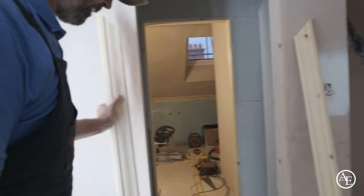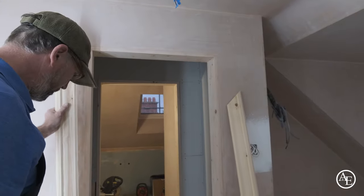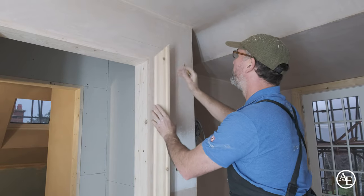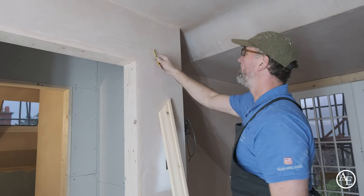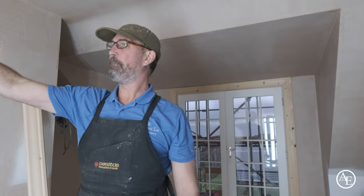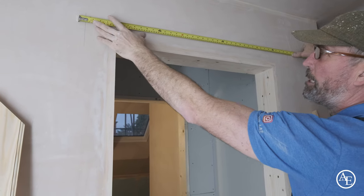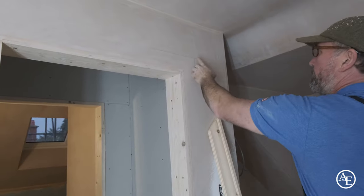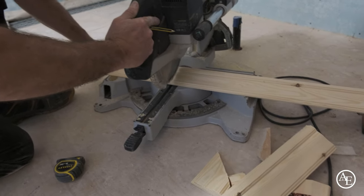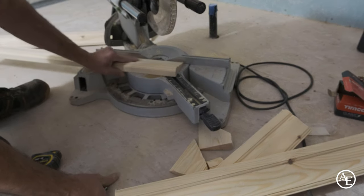I've got my left and right hand there. I won't actually fit these until I get a piece of architrave — let me just run that up there for a second, measure what I need, back that up, and measure that overall length. I'll make it longer and just do that 45. I always work from left to right. It's about a metre 40 — I'm just giving myself a bit over on each end. That's my long shoulder length — a metre 40. I'm just going to square that off, spin it around and cut that one in at 45.